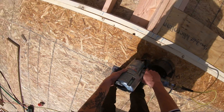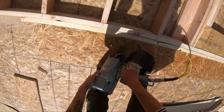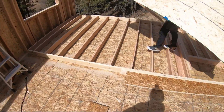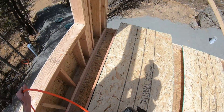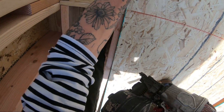We get our blocks to set the rim joist flush, and then we just go ahead and nail it six inches on center all the way across. We only partially rimmed this one, so that way once our wall is stood, we can set a long piece that goes over the overhang and ties it all in nicely.